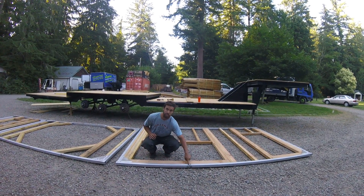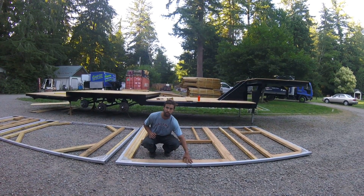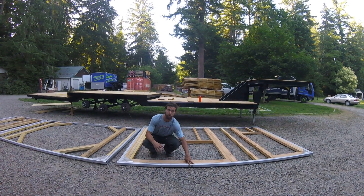Some of it wasn't long enough, so we've spliced it. There's a sleeve inside here that we gap to the right size for everything. We have a jigging table inside that we straightened it on, and it's all been rosette welded on either side.